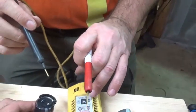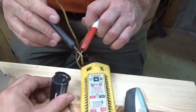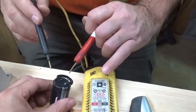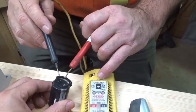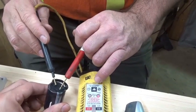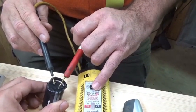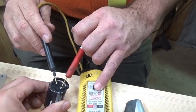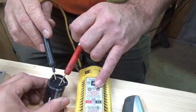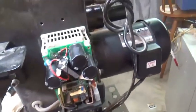I've got my meter here and I'm testing the old capacitor. You can see the continuity light coming on and off — that's continuity. I shouldn't be reading continuity; I should be reading microfarads with a capacitance measurement. But there's a dead short — that capacitor was the culprit. I've gone ahead and screwed the VFD base back onto the lathe.